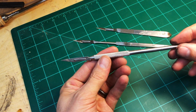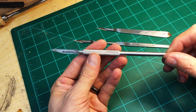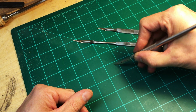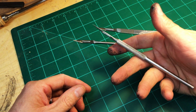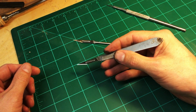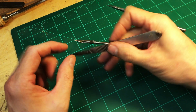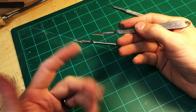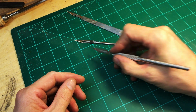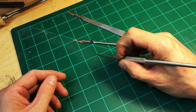This next one I thought would be a treat. This is all number 11. This is just round and with this grip, and this is good, especially when you are turning corners, things like that. That's a nice handle. These ones, it's probably a bit easier to cut in a straight line with these. You just sort of hold it really rock steady, and it's because of these two walls, sides, but think of them as walls. It is easy to cut in a straight line. This one, it's easier to rock, so I wouldn't sort of reach for this for a straight line cut.